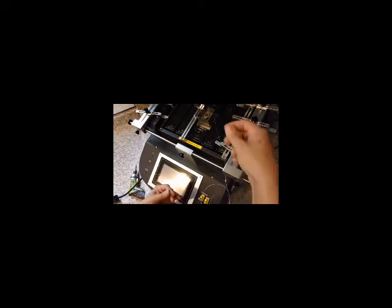This unit graphs both these connectors, so we're going to be able to watch that live while we're reflowing or reattaching a chip. Then you're going to take your main connector, which is your primary. It's a fine, thin wire, a little thicker than a hair, with a very tiny tip. What you're going to want to do is run that around the outside of your other connector. This is usually run down the right hand side, and it comes in under the nozzle.